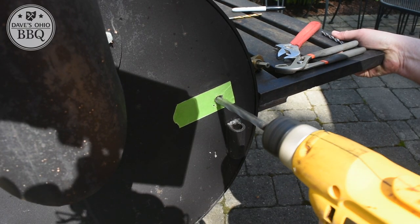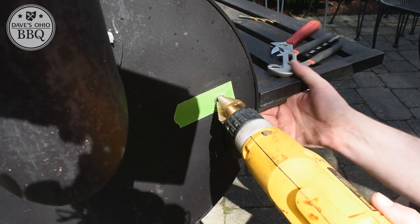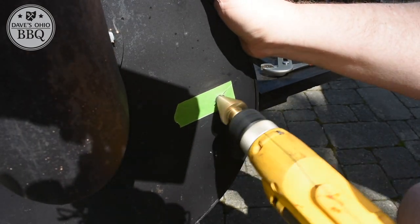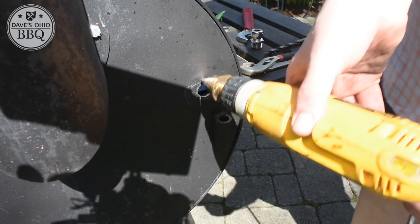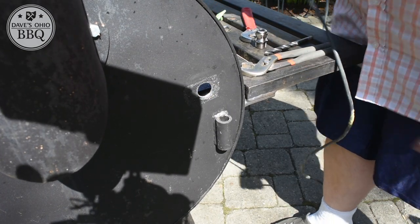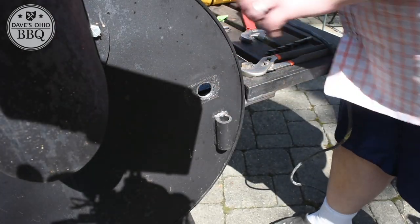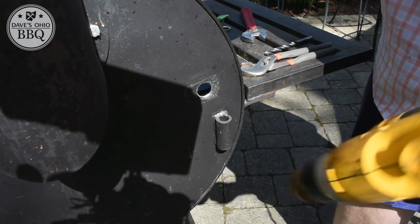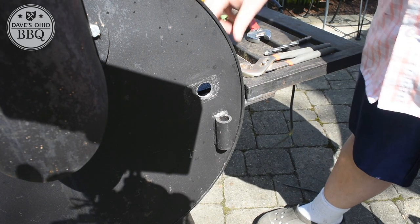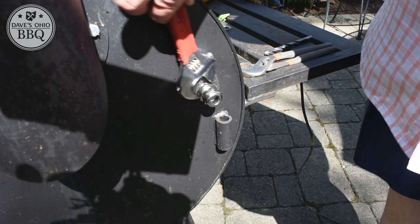I went to three-quarter inch to get in through there. My drill bits are kind of dull so it took a really long time. Then I took the step drill bit — I didn't want to go all the way to seven-eighths because that's slightly bigger than the required 27/32nds. Once I got to three-quarters of an inch I just lightly feathered it. Going from both sides creates almost like a thread, like a peak inside the hole. Then I took the probe port and could just thread it on there. With the back washer on and alternating tightening back and forth, I got it snugged up really tight.